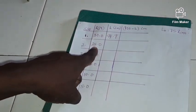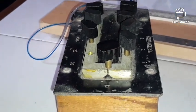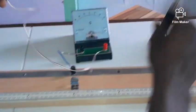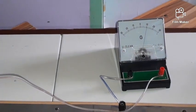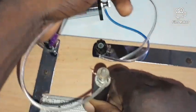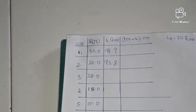For R = 25 ohms, I remove plugs for 20 and 5 from the resistance box. Closing the switch and sliding the jockey through, we get the balance point — reading: 93.5, 6, 7, 8 — so 93.8. I record 93.8.